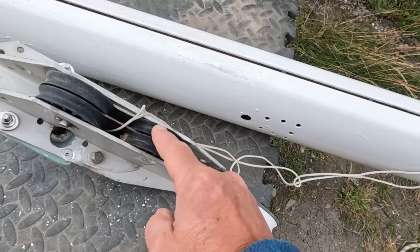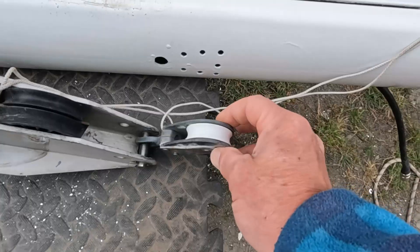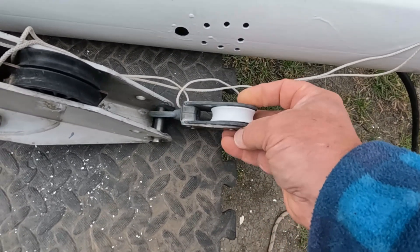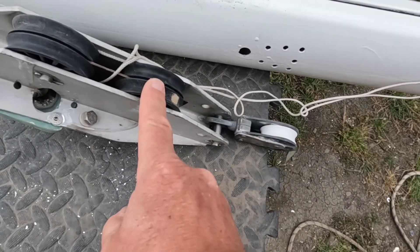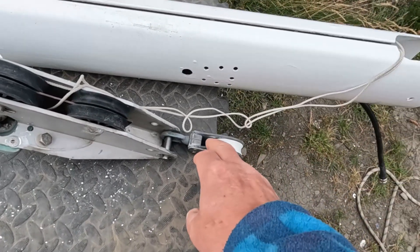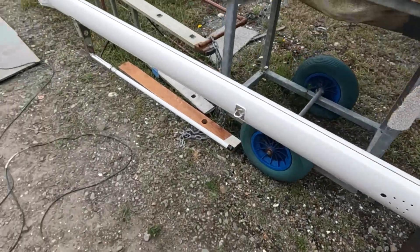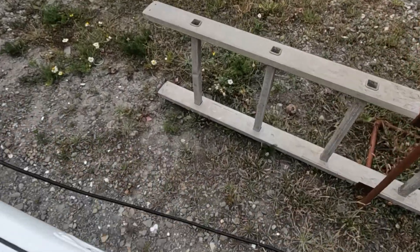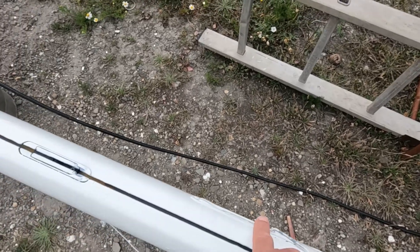This position was used for the topping lift, one for the main halyard, and one for the staysail halyard. What I'm wondering is: can I take from the topping lift block — which will be a replacement for this — and go into the sheave here and down the mast from that articulation, or do I need to keep it as an external topping lift? If I do go internal I will have to make some changes because currently there are only two sheave holes in the mast for lines to come out.